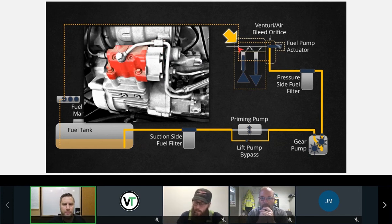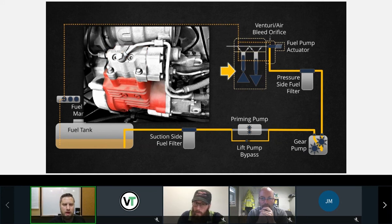Then we've got our pump head. That's the top part here. You can see there's some check valves in there. The barrel plunger assemblies are threaded into this pump, and we'll see another picture of that later on as well. And then here's our pump body. This pump body is oil lubricated. It houses our cam, which drives our barrel plunger assemblies. So the bottom end of the pump here is lubricated with engine oil.